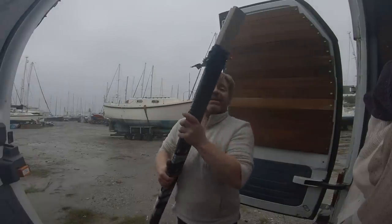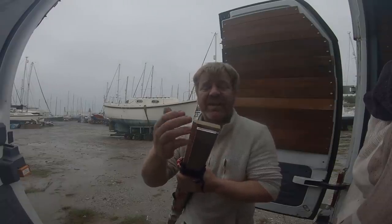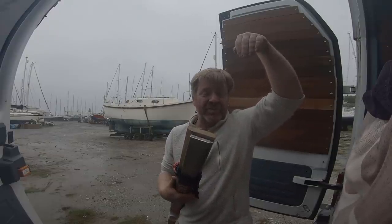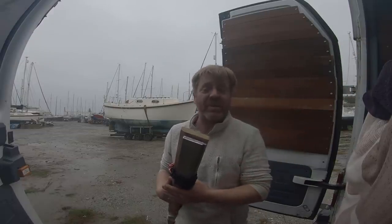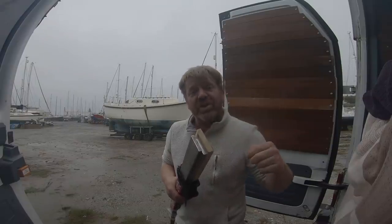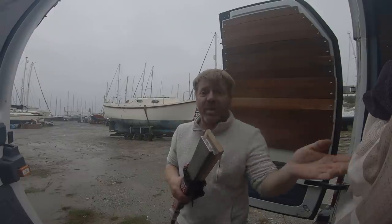And then here, what I've got are two meter lengths of stainless flat bar, 10 millimeters thick. These are going to be what I use to make the new chain plates, which are going to go through the roof of the coach roof, onto the back of the transom and everywhere else that we need the chain plate. So I've got plenty of this 10 mil stainless flat bar, which I will weld to the mild steel using a dissimilar metal rod and then paint over the weld.